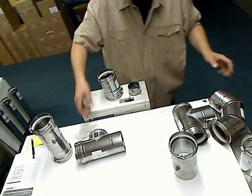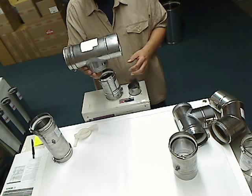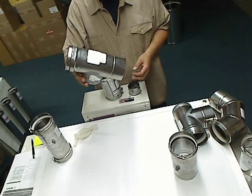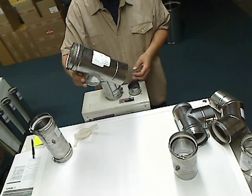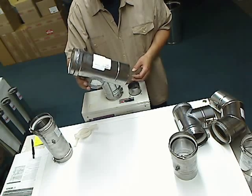The third condensate is a horizontal condensate drain, meant to go in a horizontal position. If you're using 45-degree elbows for any kind of offset and you want to place the horizontal drain in this position, it will not work — it won't drain the condensate out.